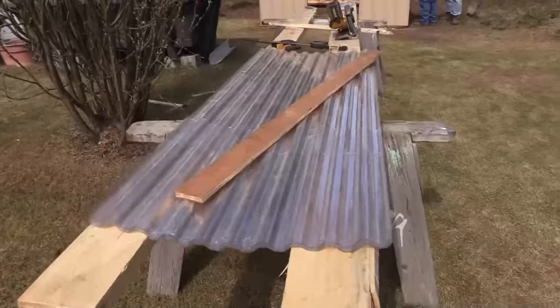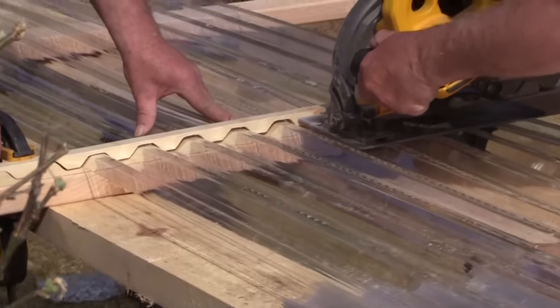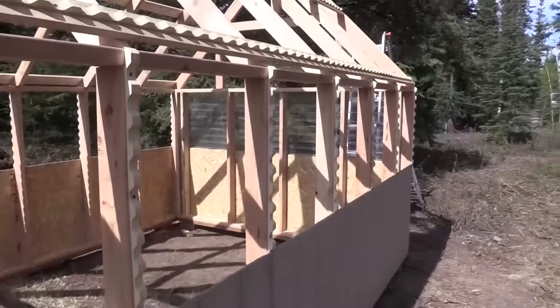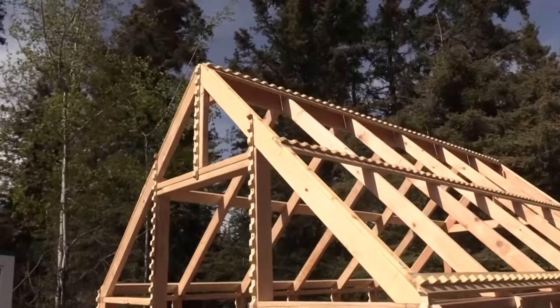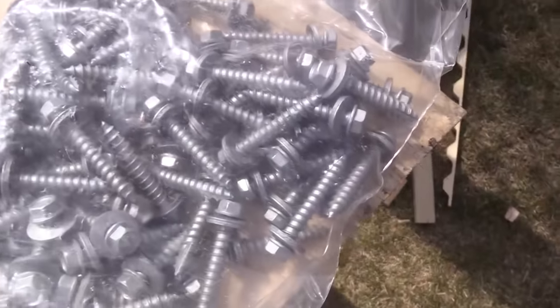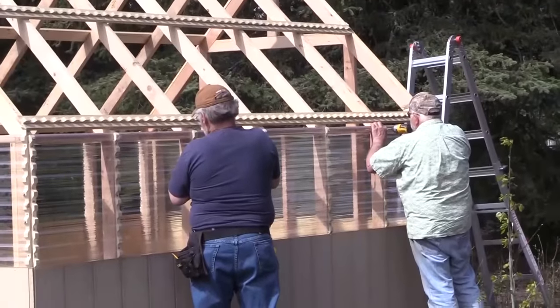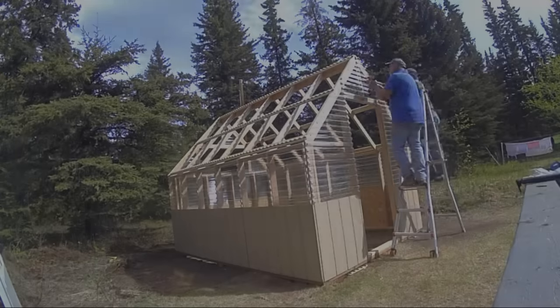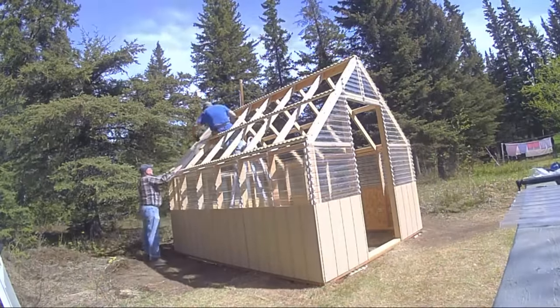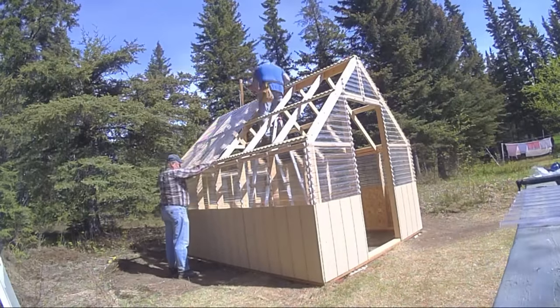And there's our corrugated material. We bought all 12-foot pieces, and in a couple of places we had to cut, so we used scrap wood of the wavy strips to sandwich in between at those cuts. The wavy strips are all up, and it's time to screw on the plastic panels. The sides don't need to be cut because they're 12 feet long — you can literally just grab the panel and stick it up. The small triangular pieces are a bit more difficult to cut but you can cut those from the scraps. The roof pieces are exactly 6 feet long, so all you do is take a 12-foot sheet of corrugated plastic and cut it in half.